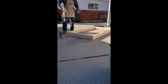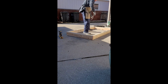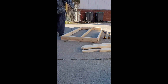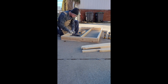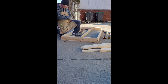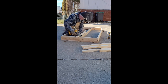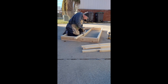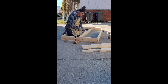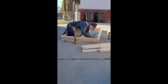So here we're going to take some measurements, basically just measuring for a 2x4 that I'm going to run down the middle for support. Then let's go ahead and check it for square, make sure we're okay. There's the 2x4 I put down the middle — that's going to act as a support for the mattress slats. We're going to screw slats on top of that so the mattress goes on top. I'm putting these support rail pieces on the perimeter, and they should be the same height as that 2x4 so we get a nice flat surface. I want the mattress to sit about an inch to inch-and-a-half below the edge of that 2x6.